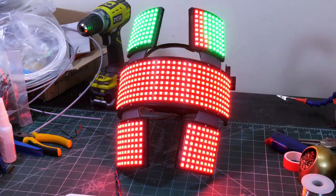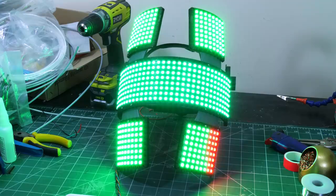And this is not using for loops anymore, so I'm doing this sort of multitasking, checking the time's elapsed and colouring in the pixels, which means I can do other stuff at the same time, like read DMX data or read anything to do with button presses and things like that.